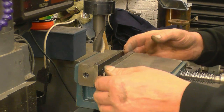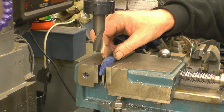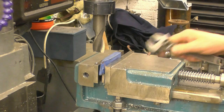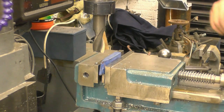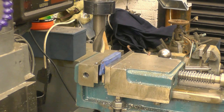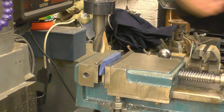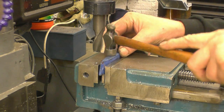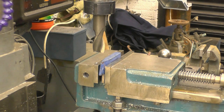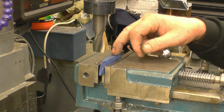Getting it parallel in the base first. I can see 360 thou there so I can get 350 off — the tool seems to be nice and parallel. It's going to get a good hold on the base. I've got a two-flute end mill in here; I'll give it a try nice and slow, and I'll probably end up putting cutting water on as well.